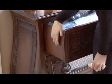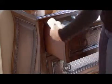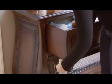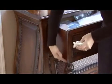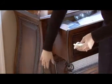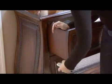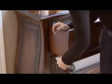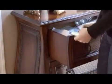If you have an older dresser, the drawers may not already have a track built into them. A lot of times the drawers just sat inside the space made for them. In that case, you would need to find wherever the wood is rubbing against other wood and rub the wax on that area. Just rub it on this part and on the other part, and it should glide perfectly.